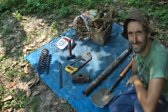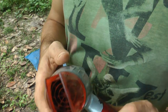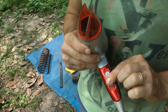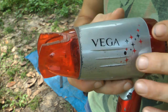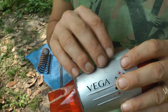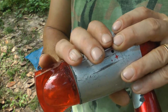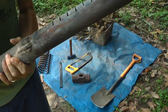This is a hairdryer that has a cold setting, and that's what you want — a cold setting so that it doesn't overheat when you're using it for blacksmithing, because you might have it on for several hours at a time. You don't want a hot setting because it'll just melt.